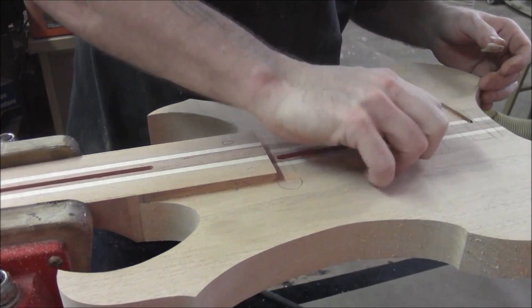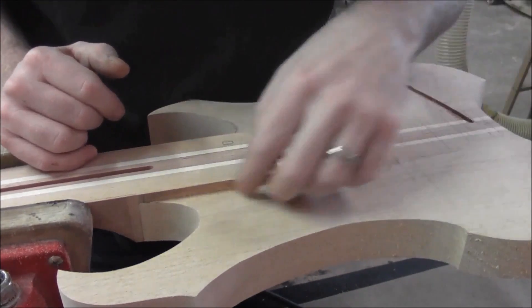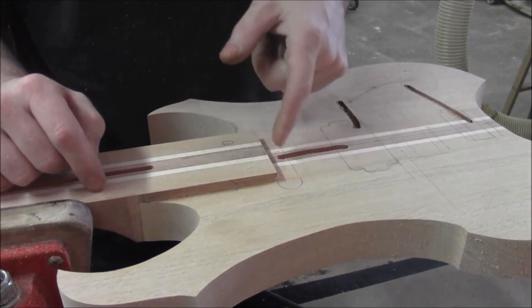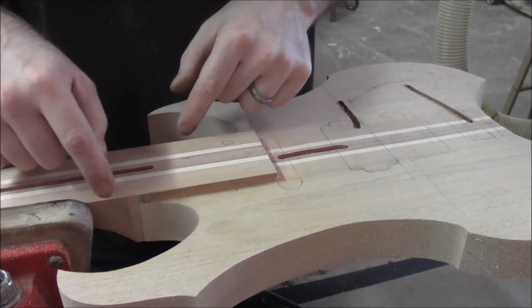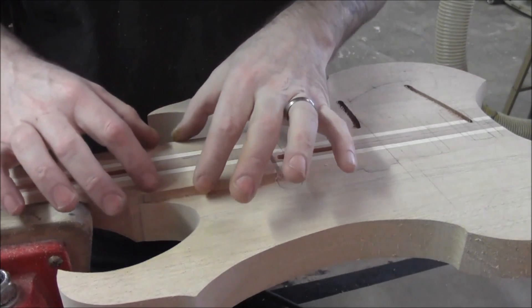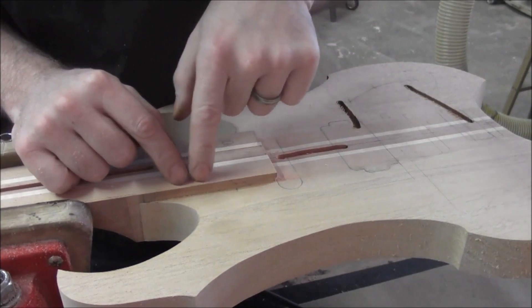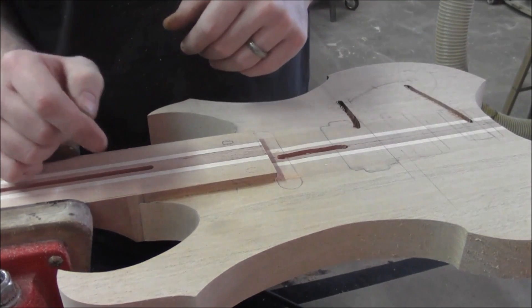We're going to peel up the two-sided tape from those guide rails. The next step before working on the top is the area on the neck where the body meets the neck — we're going to have to cut this to the true finished edge line. When we take this bookmatch top and cut this area out, we want a very nice perfect fit. I've put our fretboard on top, lined everything up, and marked the lines — with the binding included of course — so make sure you're using the bound fretboard when making these lines. We'll grab a sharp chisel and work away at this.